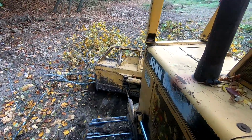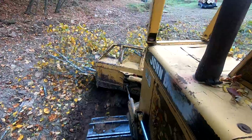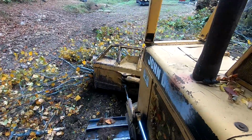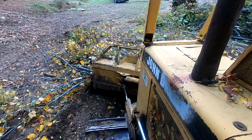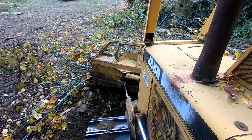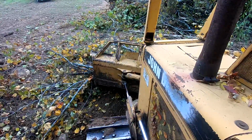So what we're doing here is we're taking the dozer and we're piling all the stuff close to the pile. Now, we can take the excavator and in 4,000 little trips going down get every thumb full of stuff and drive it over and set it on there. If I don't have a dozer on the job, that's what I do. I have a dozer there anyway, and what I like to do is get it close to the pile. You'll see I'll get up here pretty close and I'll just stop.